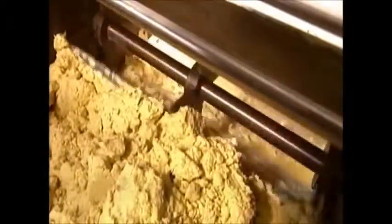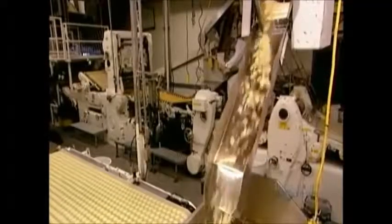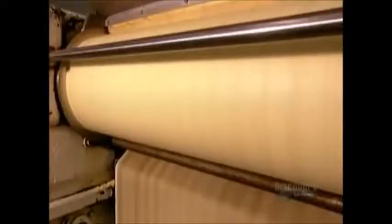From the mixer, the dough goes into a machine called the chipper. It shreds the big blob into pieces about the size of the cap on a highlighter pen. This makes the dough more manageable for the next machine, called a rotary mold. Inside that machine, a large roller flattens the dough pieces, forming them into a dense sheet about 1.5 centimeters thick. It then presses the sheet against another roller, whose surface is a cookie mold.